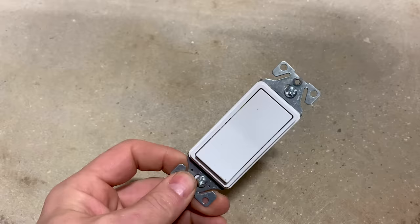Since we just talked about car flex, next are car flex connectors. There are two main types to concern yourself with. This is a car flex 90 — a 90-degree connector — which you'd use when the box you're connecting to is at 90 degrees and you don't have room to run straight in. This is a straight car flex connector. Just know there are two different kinds depending on what space you have and where you're coming into an enclosure or box.